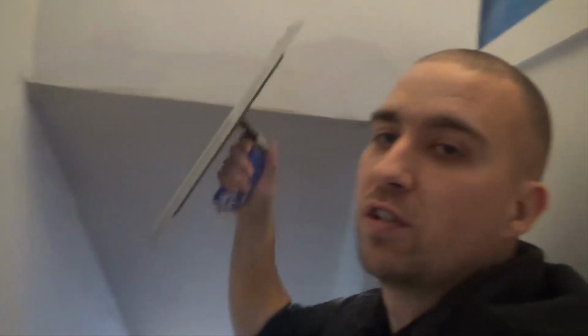Don't be afraid, guys, to try and improve it. Again, you could use a rule. You could tack a rule on and work to the rule and cut it off, but then it's more issues. You're going to have holes and stuff to fill, and it's all the same, guys, really is. And the more times you do it, the better you get. But I'll bring this up close, and there's no hiding in plastering, guys. Everybody's going to see it. So if you can see it, the customer will see it.